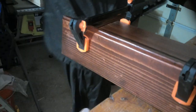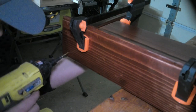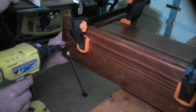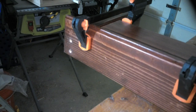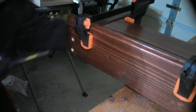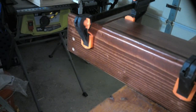Now that everything is pretty much done on the cabinet itself, I'm going to add the final piece, which is the top portion. I'm going to be using my counter-sinking bit to drill two holes into the 2x4s and attach them with screws. I'm then going to use some wooden dowels to plug up those holes, sand them down, stain them, and finish them as well so that you'll never know they're there.